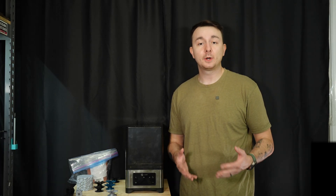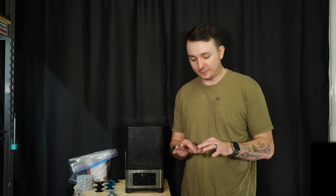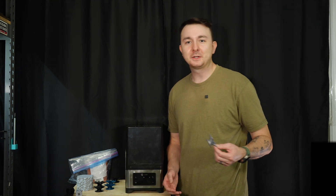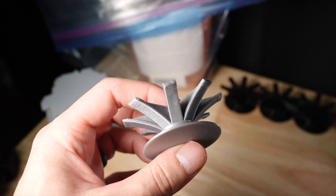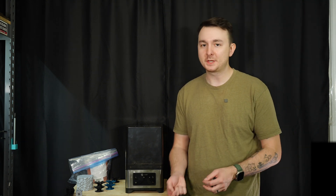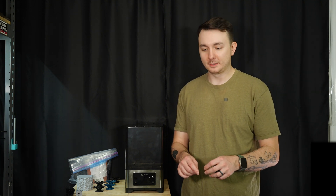Since that experiment didn't turn out the way I wanted, I tried a couple other things. I went digging and found my oldest roll of PLA, which came with my Mark III probably over two years ago, and it's so brittle that it just snaps. So I ran a print with it, and the funny thing is the print just looks fine — I really wasn't expecting this, and it came out perfect. But I figured let me try to dry this thing and see if I can get it to not be brittle anymore, and I did. I've got video of before where the filament was just snapping, and I've got a section here where it bends and is compliant like PLA should be.